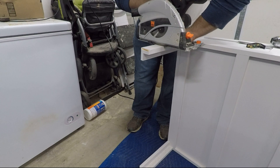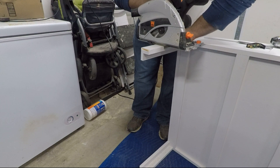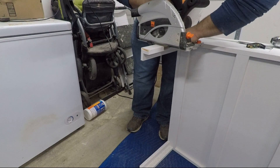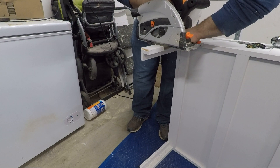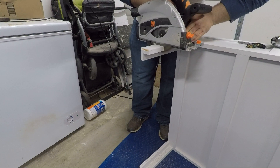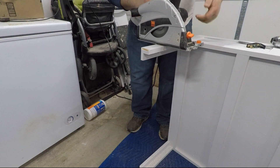I'm going to use my track saw. The reason I'm going to do that is that my track saw is a circular saw but it has a plunge feature, and I think that'll help me keep more control and make the cut a lot smoother. So fingers crossed that this goes well. Here we go.